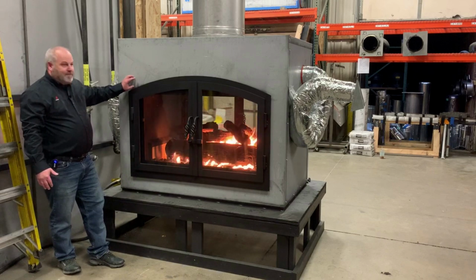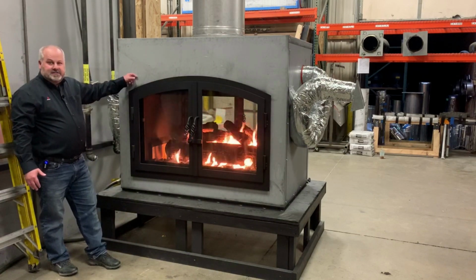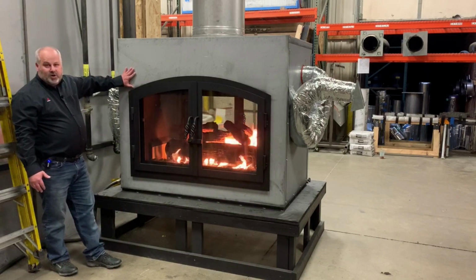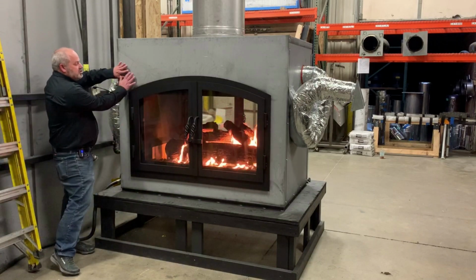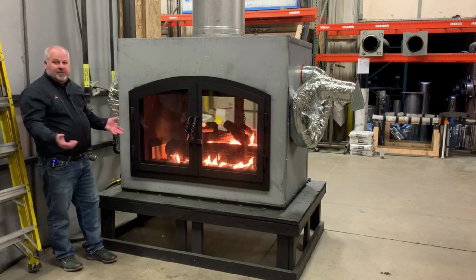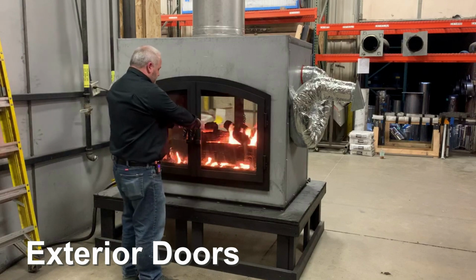So now, instead of having that air vent through here where that heated chamber is, we run that insulated panel system directly down to the face frame. So now when you stone this fireplace in, you're actually going to run your stone finish right to the face frame and build it in, and there's nowhere for air to move through that fireplace. Still got the same door system.